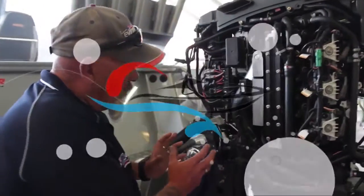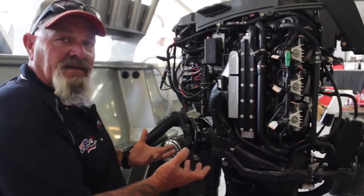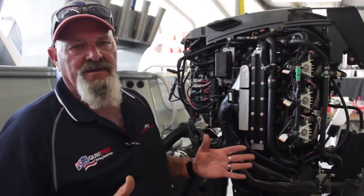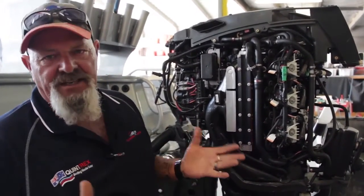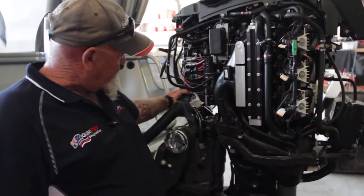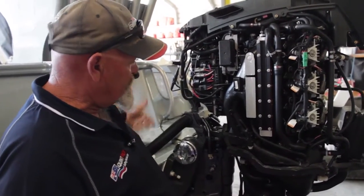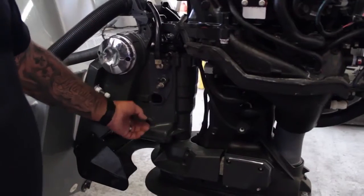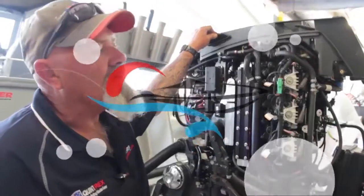What iTrim achieves for the end user is like cruise control in an outboard — you simply apply the revs and hang on to the steering. You can change the steering setting — lighter or firmer — at the touch of a dial. All of this is achieved through these couple of cables here; you can put your fingers around them — that is the whole rigging for this motor. It fits neatly in this tube and continues up to the forward of the boat. This DPS unit is your power steering, your trim, everything — all in one stem.